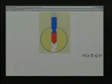Even more difficult than that can be spool pins. These spool pins give you a false sense of progress. You can picture how it'll bind normally, and I'll feel up, and I feel that click, and it even rotates the plug a little bit, and I'm going to keep picking and say, why isn't it open yet? Well, because you're probably hitting a spool pin if you try over and over and over. There's also pins that are called serrated pins, which jam all the time.